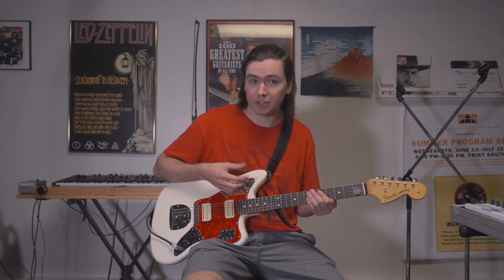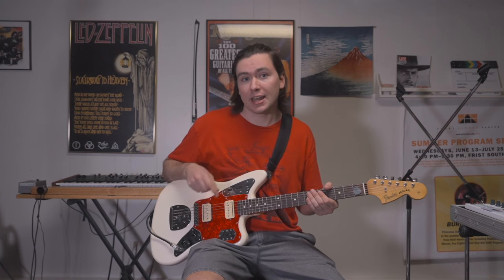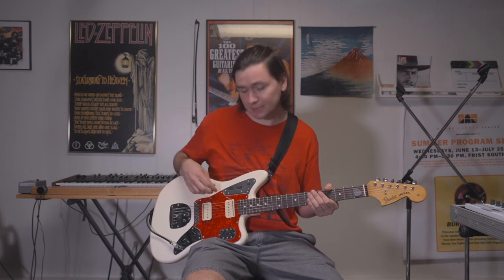Sadly, I also ditched the kill switch, but I could probably still add it back in later. I found a wiring diagram on Seymour Duncan's website, which I'll link in the description, and I sourced two Bourns 500K push-pull pots and a 0.047 uF capacitor from Amazon. I also decided to add a little pizzazz by changing the pickguard to a red pearloid one from WD